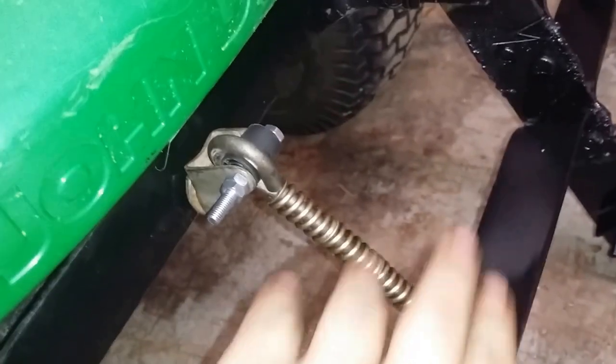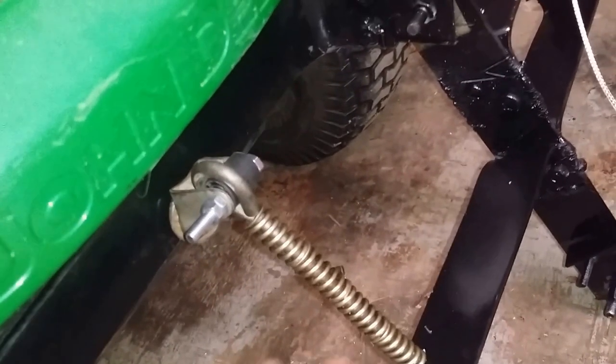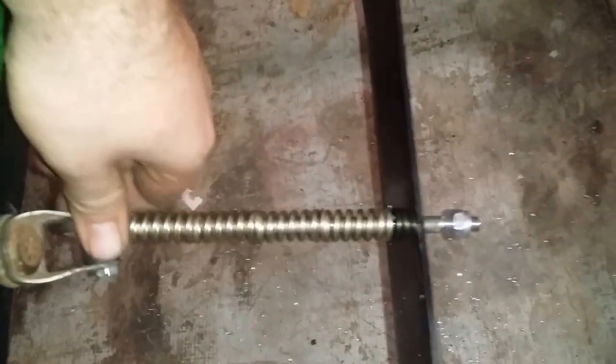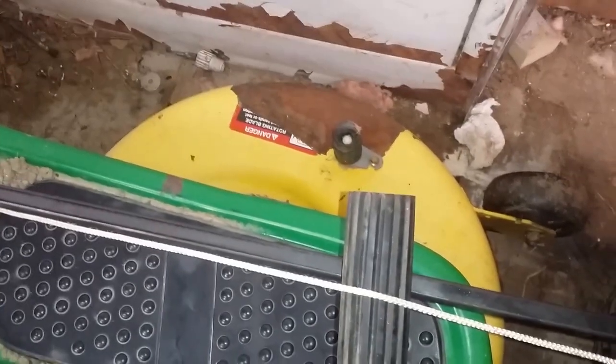Here I have a spring assist I made. These are as simple as just some springs that came off of air conditioning compressors, just bolted and drilled through the frame here. The handle right here, when you're sitting at the seat, I need to adjust to where it doesn't swivel anymore. It's just a chair swivel. But when you're sitting in the seat, it's as simple as just lifting it up, shoving it under the brake footrest, which can still be used. It doesn't affect its functionality.